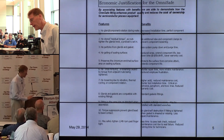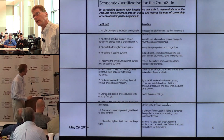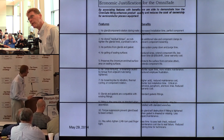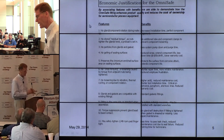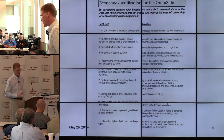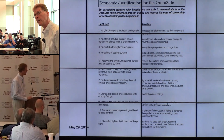A fitting without torque has no loosening, no stored torque, no particles from the glands and gaskets, and no galling of sealing surfaces. It produces a chromium-enriched surface from electropolishing. You also don't get cross-torque — where tightening one fitting causes the adjacent one to loosen, sending you back and forth in a frustrating cycle. With torque elimination fittings, we eliminate that problem completely.